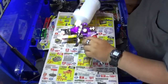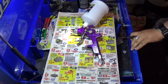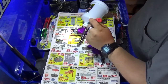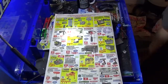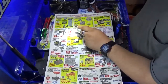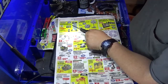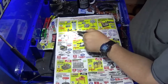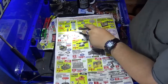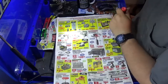So, you buy the oil lube compressor for your air tools, not your pneumatic paint guns. And to have a proper air filtration system, putting on one of these is going to cost you more than what one of these is costing you. Okay? Because this $159.99 compressor, to get that gun to work properly, you're probably going to be looking at $120 to have a proper air filtration system on that compressor to run that gun.